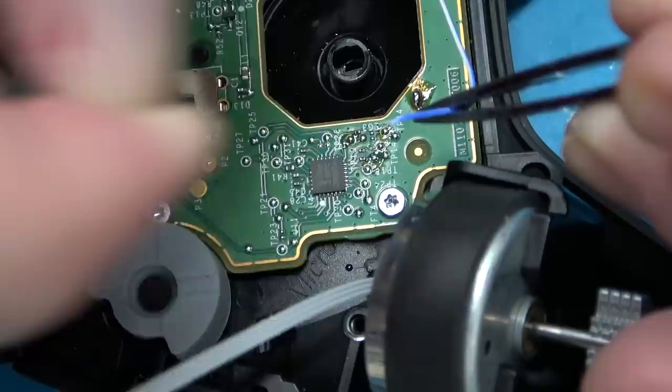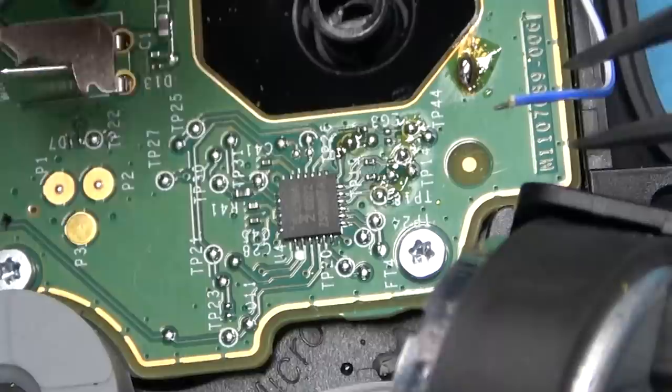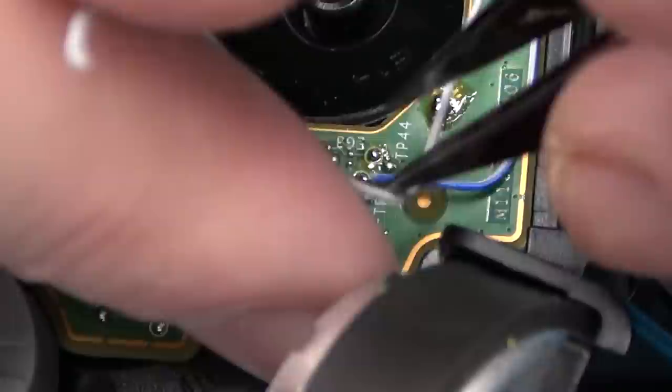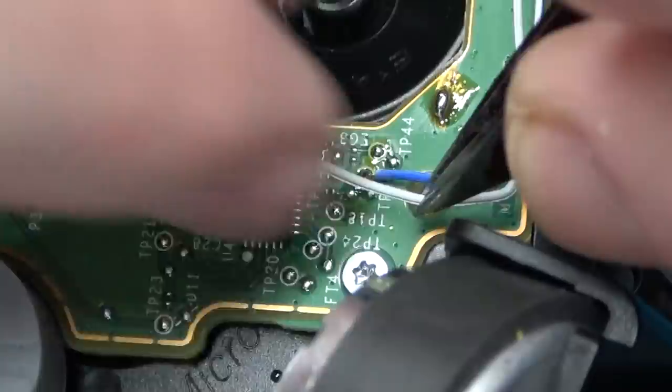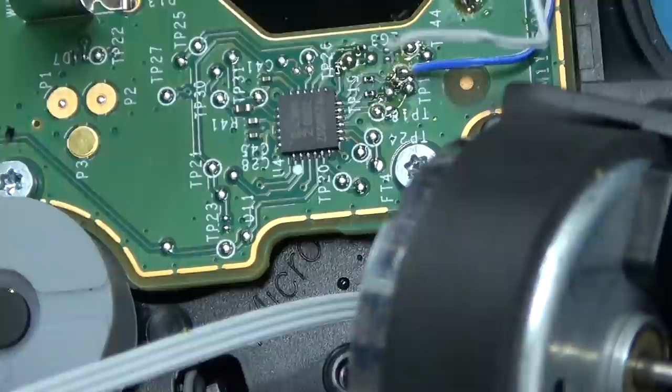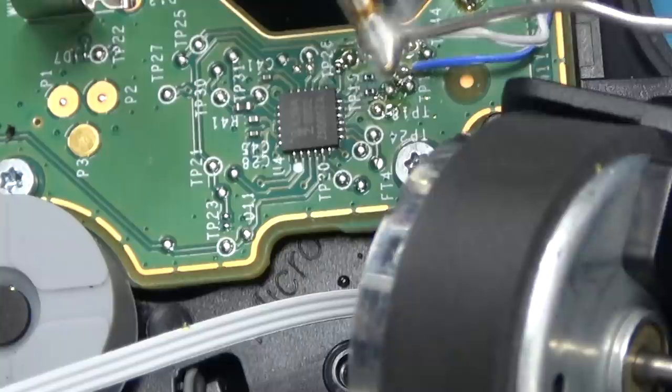So Microsoft added that integrated circuit so they could remove a connector. The buttons attached to this chip come over a serial bus — which would be pretty much everything except the B button — they'd be collected and everything sent over as a frame. But if you're trying to run this thing as fast as possible, that would create a lag bottleneck — a pretty imperceptible one in the grand scheme of things compared to game engine speed, but still.